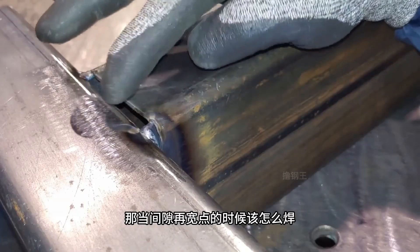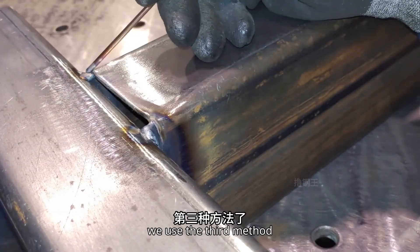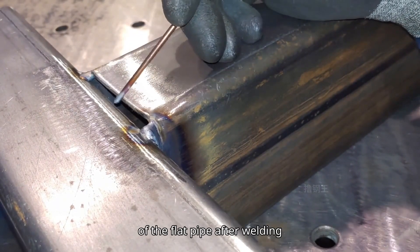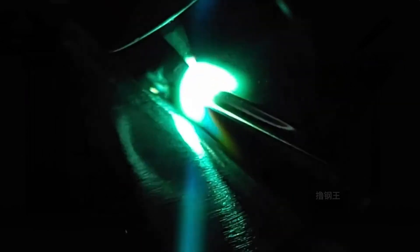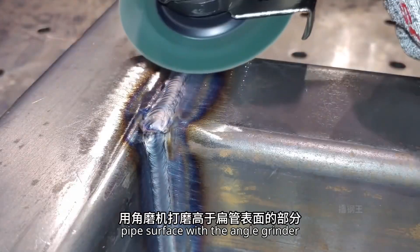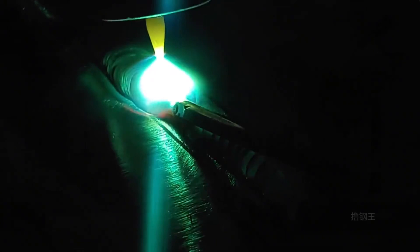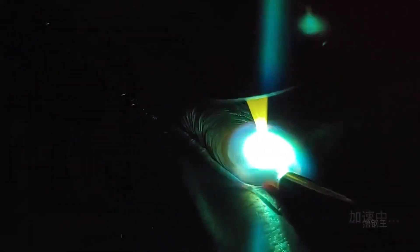That's what the weld looks like when done. What if the gap is wider? If the gap is completely filled, the weld might look too large and unattractive. In that case, we use the third method: perform additional welding at the angled cut of the pipe to reduce the gaps. The weld must be above the surface of the flat pipe after welding, so you can grind it with an angle grinder, which will be more convenient. After grinding, the remaining gaps have reduced, and filling the welds is much easier. Grind the part above the flat pipe surface, then locate the marked area for cover welding.